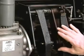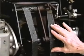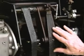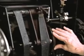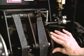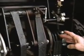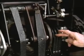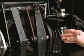Aside of it is the cam and the lever that control the turning of the spotting cups from the horizontal to the vertical in a spotting cycle. Next to it we have a shuttle cam. This controls the movement of the shuttle, permitting pins to be put into the spotting cups. The table movement itself is controlled by a series of cams and levers here, one to control the home position, another the timing of sweep movement, and an interlock protection circuit.